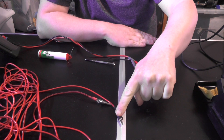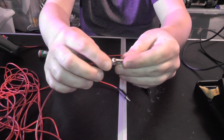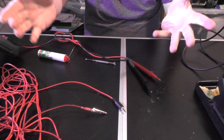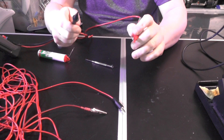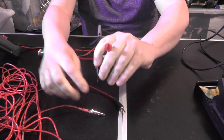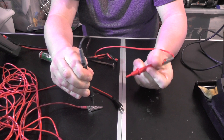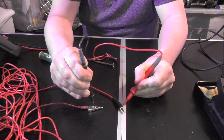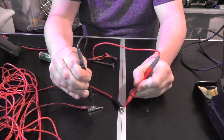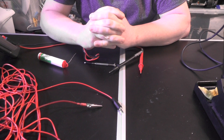Okay, so the black plastic part is on and it looks like an okay connection. What I'm going to do — as I've done here to the crocodile clip — is add some heat shrink to it. But first I just want to check the connection is working and that I've soldered to the right plug. I've got my DVM in continuity mode, so let's check it. We've got a beep! I'm going to try it on the crocodile clip. The crocodile clip is optional — it just helps you clip it up. You can tie it up any way you want.